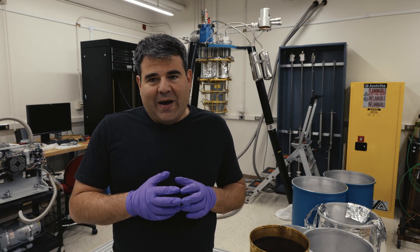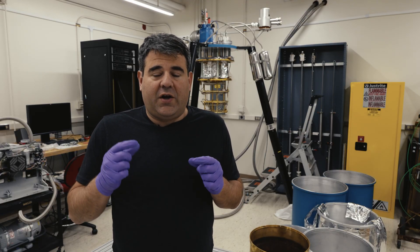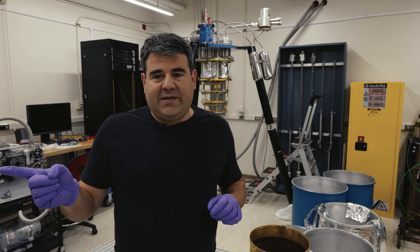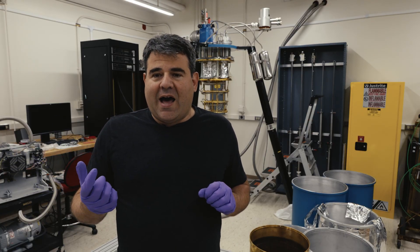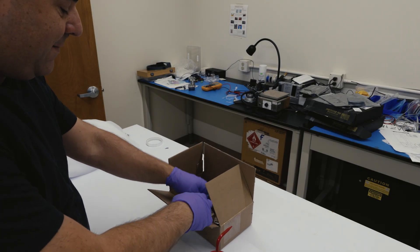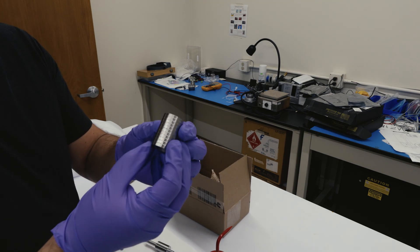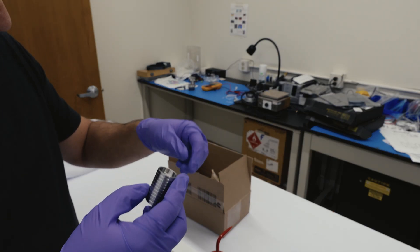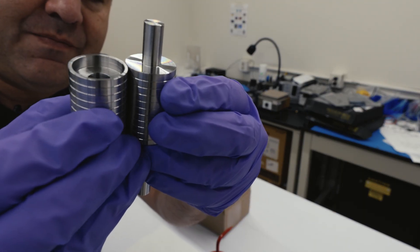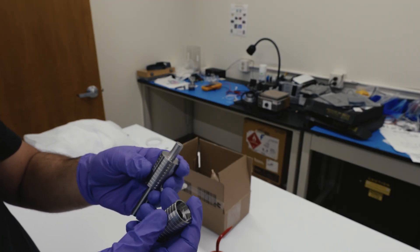But the first thing is the rollers. I made almost all the parts except the rollers themselves. The rollers are 17-4 stainless — I wanted them to be really hard and they're a CNC lathe part, so I took them to the shop. They look great. You can see they have some grooves on them, and these fit together — the grooves match and that will roll the part out and make the shape we want.